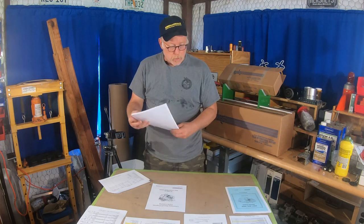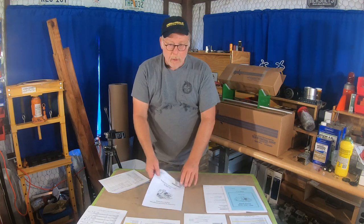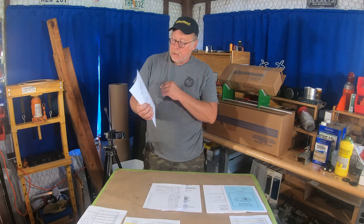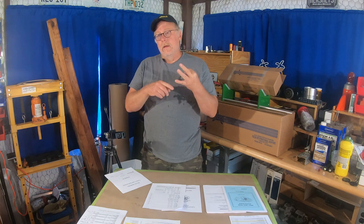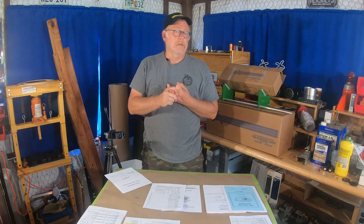So the SSP 1776 — that's real important. Now we know how to overhaul the engine, we know what to measure to, and we know what parts go into the engine. Next thing we want to look at is the SSP 112-11 index, which is the index of service bulletins, letters, and instructions. There are three basic documents that the manufacturer puts out in addition to operating manuals and parts manuals. One is a service letter, another is a service instruction, and the third is a service bulletin.